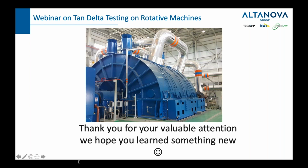1455th. Can we measure tan delta on the bus bar of a generator and how to evaluate the result? I'm not sure. Tan delta can be measured for all parts that we have, everywhere, because it's a measurement of the insulation. We can measure even the tan delta connecting to the bus bar of the generator. Like we saw in the previous slide, when we can't open the star point, we measure the tan delta only by the bus bar, by the terminal of the generator.